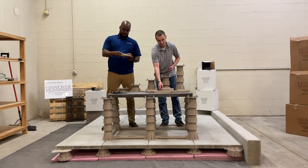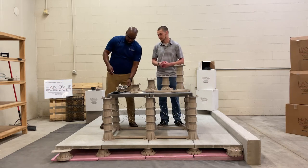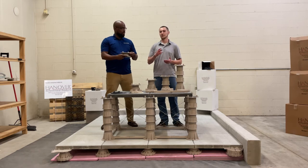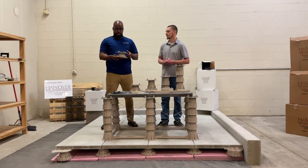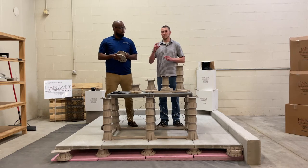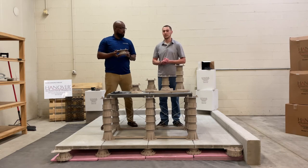Once you get to two inches, it's more cost effective to go with our elevator pedestal. The small elevator pedestal is a two-inch base, two-inch top pedestal with the same type of design — eighth-inch spacer tabs on top — but it's adjustable, allowing you to achieve heights from two inches up to three inches. The tabs on top can be modified in certain areas. There are lugs at the bottom that the stay bar can be clipped into, which we'll talk about later. We recommend a minimum insertion of one and a half threads, which is about three turns.